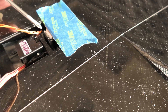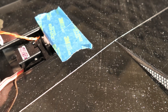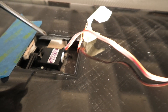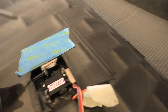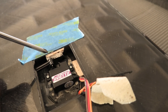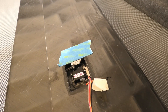I used some epoxy mixed with a lot of micro balloons to tie this little pad here to the top skin — that'll just strengthen up the servo bay area. This is the aileron servo. On the flap servo, I actually put a piece of lightweight balsa behind the servo going to the spar, with a little bit of epoxy underneath, so it basically ties the servo to the spar. I've also tied the top skin to the pad. That'll help stiffen up the servo bay — probably more useful on the flaps than the ailerons, but it only adds a marginal amount of weight.